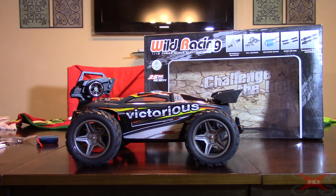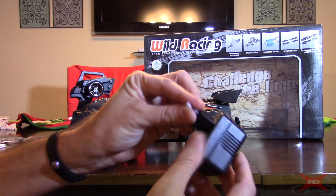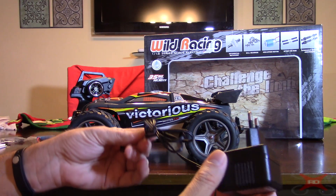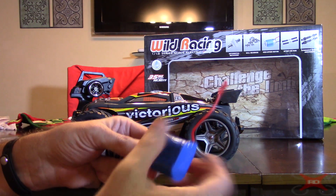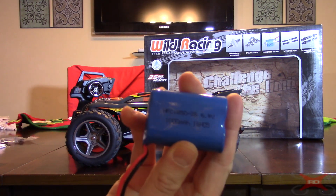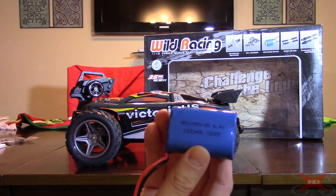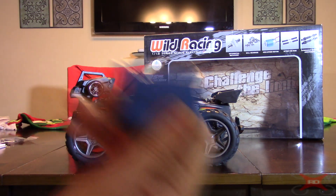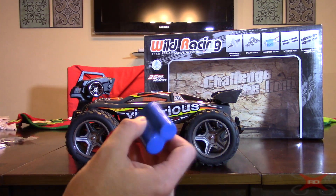The charger that comes with it is an EU plug — I have an adapter, and if you order this you'll get a US adapter if you're in the US. It plugs into the battery with JST plugs. If you have an aftermarket charger that can charge lithium-ions, I'd recommend that because it's going to be quicker. My IMAX clone charger doesn't have a lithium-ion option — the voltage on a lipo starts at 7.4, which is more than this 6.4V pack, so I couldn't use that even though I have a JST plug for it.